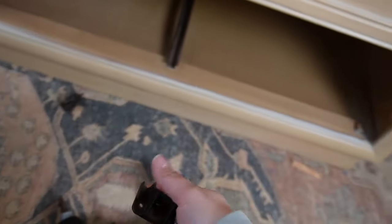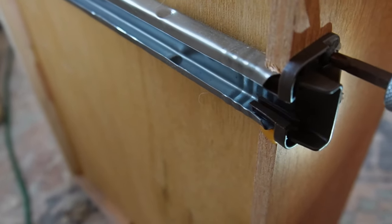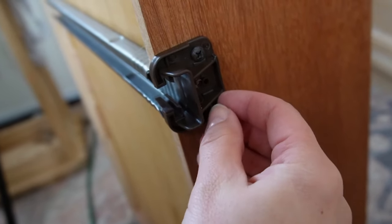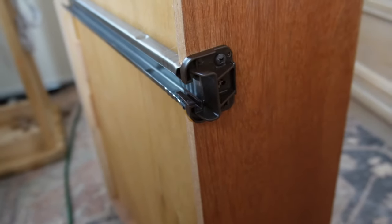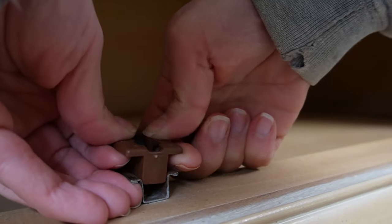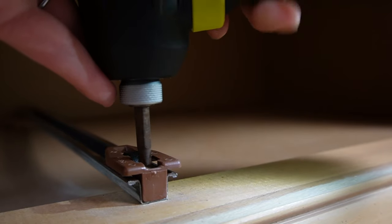This one you can see is cracked and was not working well. Those pieces get old — this dresser is probably from the 60s, so that plastic is old and really brittle. These little plastic parts are actually pretty universal and you can buy them from lots of different brands. Check your measurements, but if your drawer looks similar to this it's probably going to be these exact same sizes. I did see in the Amazon reviews where some people had to do a little bit of sanding and shaving to get the plastic pieces to fit in the metal — maybe the metal was a little smaller or had bent over the years — but it's very doable and will make a world of difference.